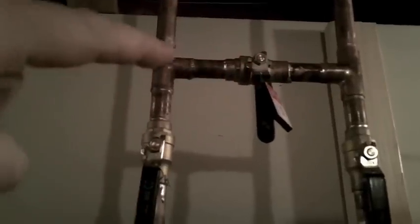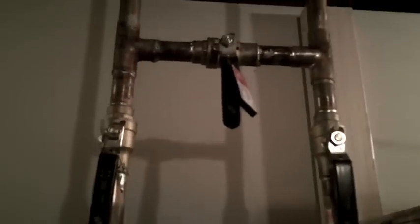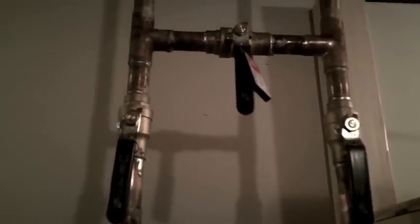As far as the plumbing goes, the main line went across up here and I cut it and ran it down here. I put this in here so you can actually have water come in around the back up to the rest of the house. Down here I've got two more shutoffs so I can shut off the plumbing to the softener and still have water to the house. Some tanks come with a bypass built in — this one actually has a bypass built in. You can pull this little handle up and it'll bypass it, but if you want to take this out you still have to turn the water off to the whole house.